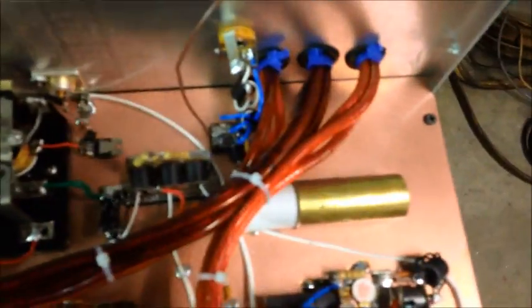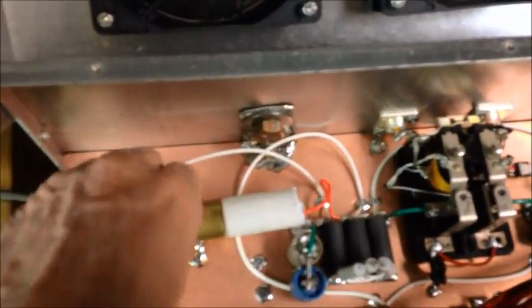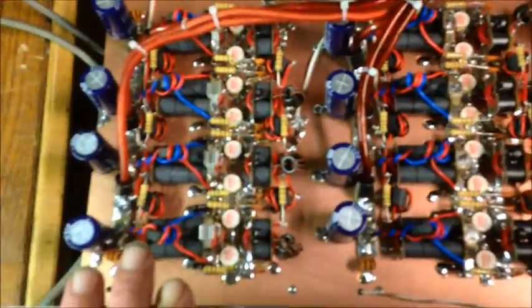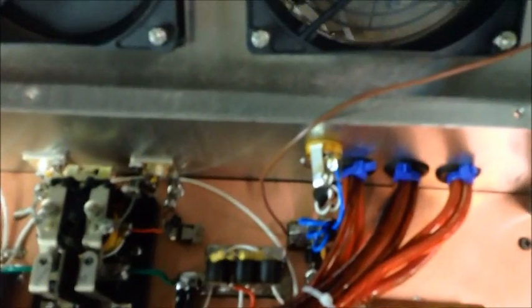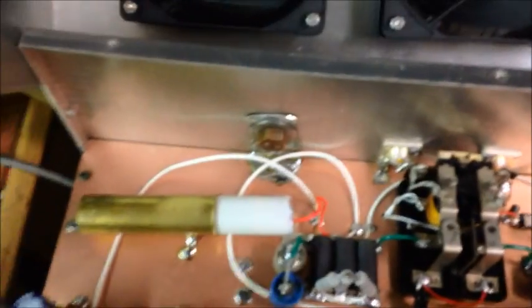Well, actually, let me just go through this a little bit. Let y'all know what I got going on here. Heavy duty relay. We don't play around. Tuners on the input and the output, backed up to tuners with doorknob capacitors. Not like some of the other guys. You know, these brass things can't seem to take but hold so much, and with the power these things put out, you need to almost back them up. Extra capacitance. He's putting this on a base. Did a couple other things to help the base power supply out some. Remote. Not sure if he's ever going to put it in a mobile or want to stick it in the other room, but good to go.